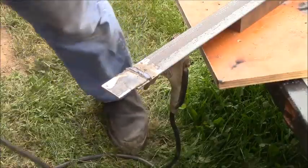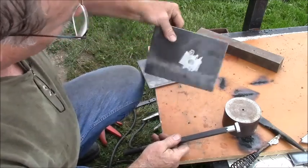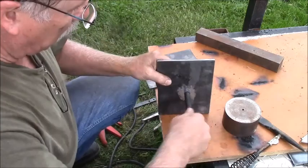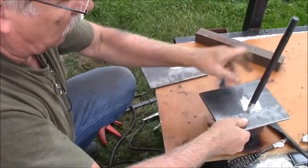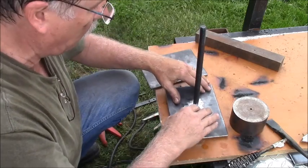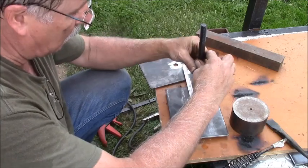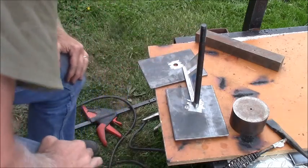I've got to come around in front of you. The next step and only last part I need to do is create these plates that I can bolt to the bottom corner of the frame. I have an axle made from a bolt and I need to make sure that it's square - that's going to be a difficult one. I can hold it with my square while I tack it. I'll tack it one way, measure it the other way, tack it, and that's what we're going to do.